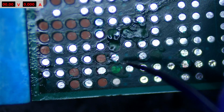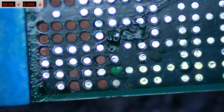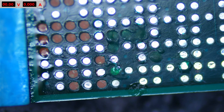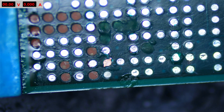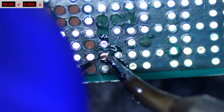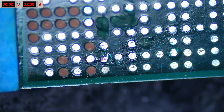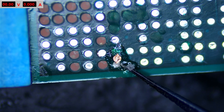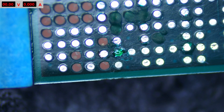Moving on — these other ones aren't going to be quite as annoying. I had already scraped through on both of these two a little bit too much, so this one might be a little bit annoying as well, but I already got the solder mask on it so I just need to scrape here. I'm pretty happy with the solder on that so I'm not going to go too crazy with tinning anymore. I'll grab one of these pads — that one seemed to work perfectly so I'll use the same kind. Come on, get this guy in place and some flux. Hold this guy in place and get him soldered down. Now I'm going to cover this in some solder mask — trying not to disturb it too much. It just came off so we gotta start again.